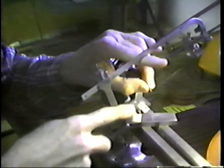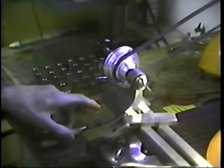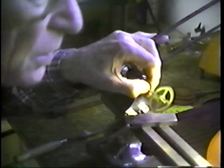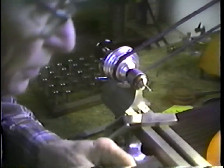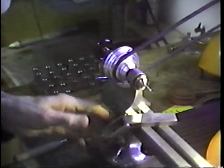The thing that I'm gaining here in this routine is that I am measuring the mouth of the hole and then measuring as it goes deeper. Right? See what we have right on the tip. Alright, let's try in there. Alright, I'm tightening up pretty rapidly, and I want to mark the point on this that I am becoming quite tight, and I'll use the dimension at that point as my working dimension. Alright, let's continue on.